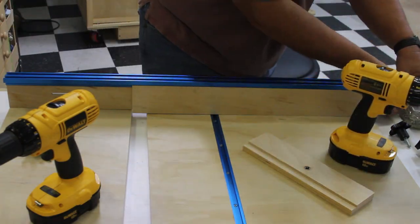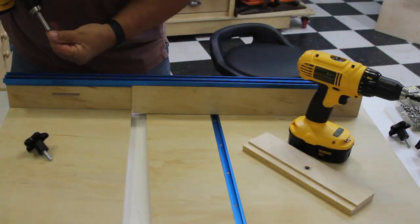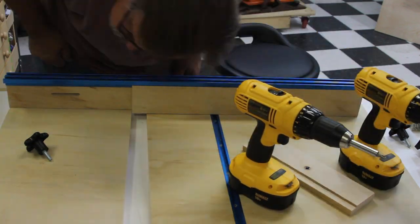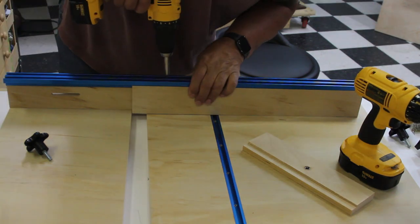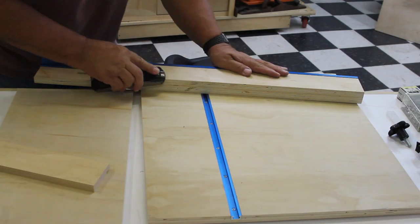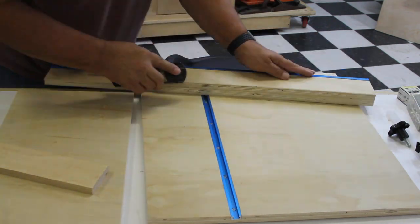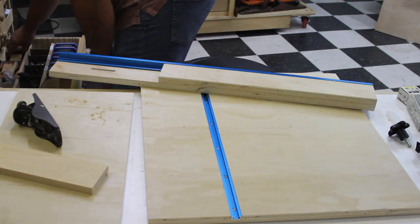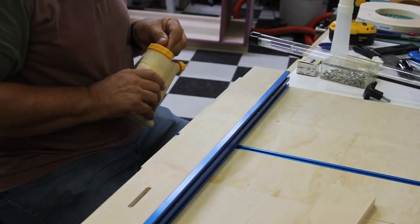The first thing I want to do is attach the twin t-track to the top of the fence. Only one side of the track has screw holes. This t-track will be used for my adjustable stop and is also a good way to make sure the fence stays straight and doesn't bow or warp later on. I used a block plane to add a small chamfer at the base of the fence to prevent sawdust from getting in the way of pieces set against the fence — it just has to be a small amount.